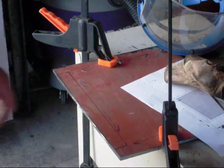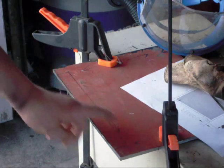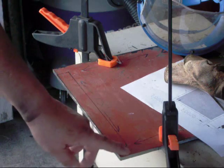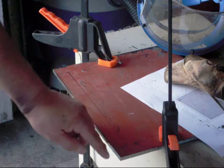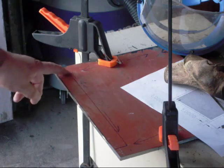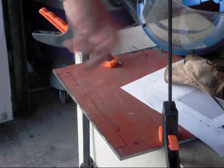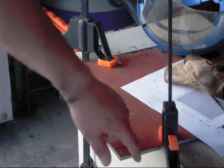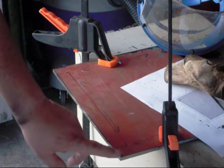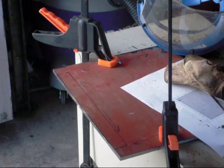Okay, what I have here is the first piece, which is the base. I have it outlined or notched here. This is the section I'm going to go ahead and take out. I ground the edges square just to square everything up so I can get 1 inch by 1 inch on both ends. This is the end we didn't cut. So now I'm just going to notch it and then cut these pieces out and then grind this flat. Flip it over and do the same thing to the other side. Square up this outer edge, and then the bottom is actually done. I'll round up these edges here, drill 4 holes, countersink them slightly, and it's done.